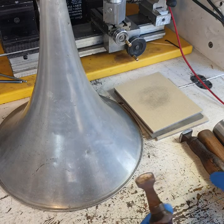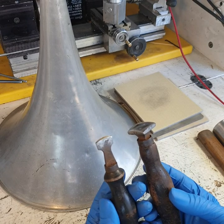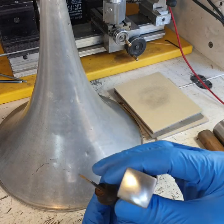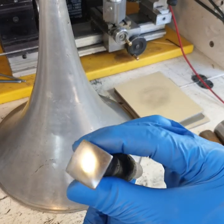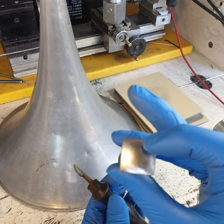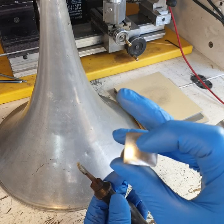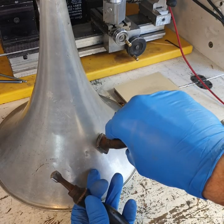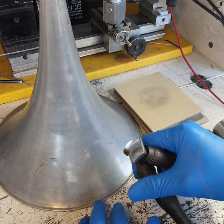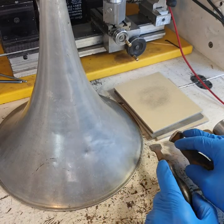What I have. Don't know the name in English of these tools. They are used in many things, like leather stamping, but also in restoring tinplate dings, okay? The main thing here is that they must be very, very smooth. Because if you have any scratch or dirt here, you will emboss that scratch or that piece of rust every time you push it over the aluminium, for example. And this is for the edges, for this kind of rims, or when you have a very sharp ding. Okay.